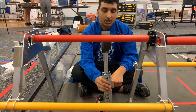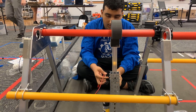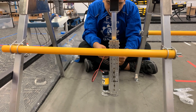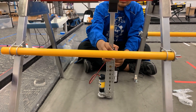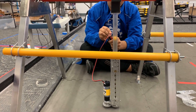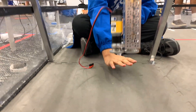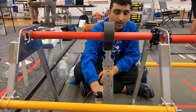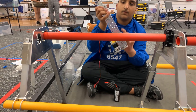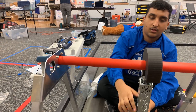Near end game, the robot can go up all the way. I can demo that now. You can make it go longer first — let's say we start like this and the robot's over here. We can start lifting the robot by pulling the lead screw down, and we'll just keep going until we stop touching the ground. We can still go a bit more up if needed, and at this point the robot should be off the ground. To make the robot fit under the rigging, we can make the U-channel smaller along with the goal rail and cut the lead screw a bit, and you'll still be able to hook up using this.